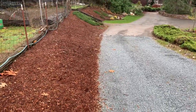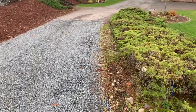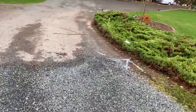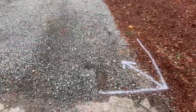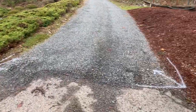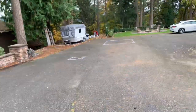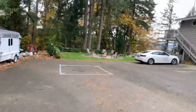If we have to push a little bit off to the left, let's do it. If we need to go a little wider than the rock and get it closer to the edge of the shrubs, that's okay. Down here that's 12 feet where the asphalt is. We'll have to go about 10 feet back from this asphalt and dig it down so we can bring that asphalt flush with the existing asphalt. Then you've got these two repairs — one is a little bigger than 1x1, more like 2x2, and then you've got that 10x10 repair right there.